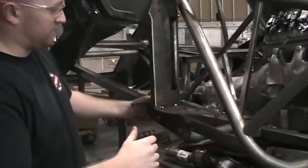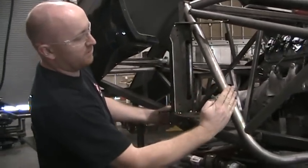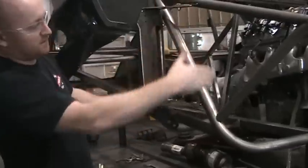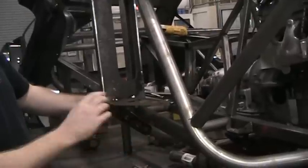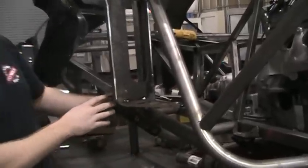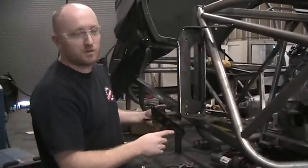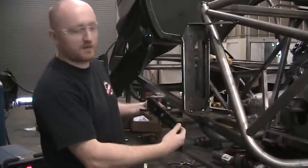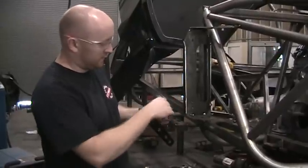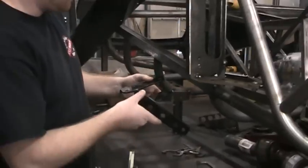So what you would have to do is reach inside the wheel well, which is pretty far back. The front lip of the wheel well is probably somewhere around this area here, so about a good foot, maybe 14 inches in front of where the component bolts on. So you can imagine it's pretty difficult to get in there, even though we've used the carriage bolts originally, which means you only have to access one side of the bolt because it's held in by the square hole that we had cut into the bracket here. So all you would have to do is tighten down the nut side.